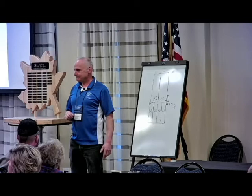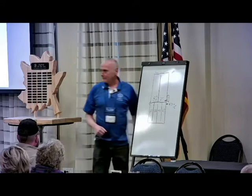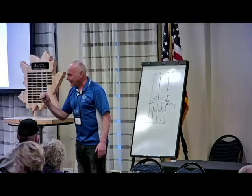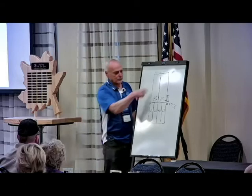How do we do that on the fly? Don't turn the heat down. We do the same exact procedure. We draw out pail A and pail B. We close the feed coming in, so we let the pan go down a little shallower, but there's nothing close to syrup in it now, is there? We're not going to burn anything. Get that pan down as shallow as we dare, and then dump pail B in. It pushes around. Pail A behind it, it pushes around. And we set our gradient to the other side, and then switch your flue pan, and away we go. And you'll make syrup again.